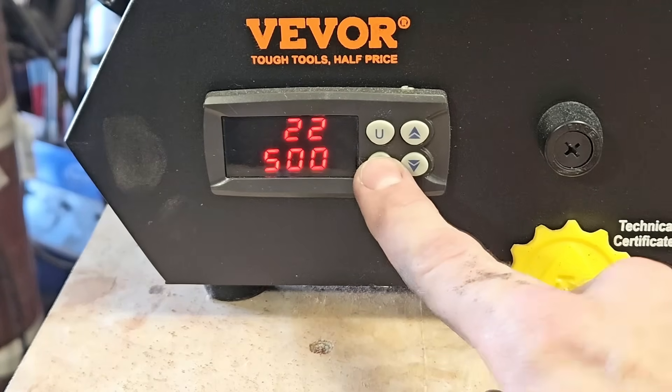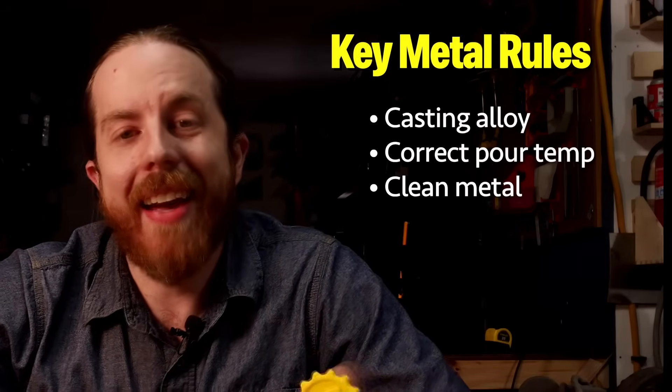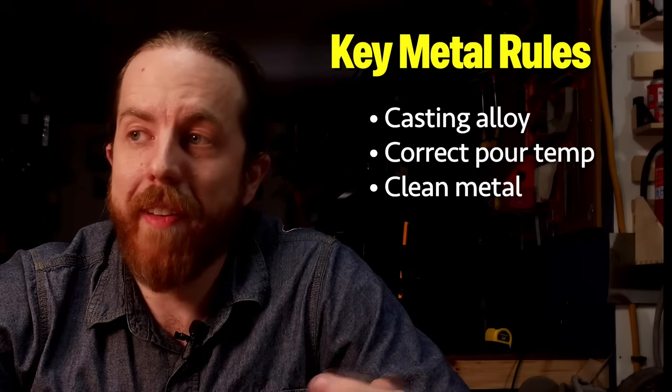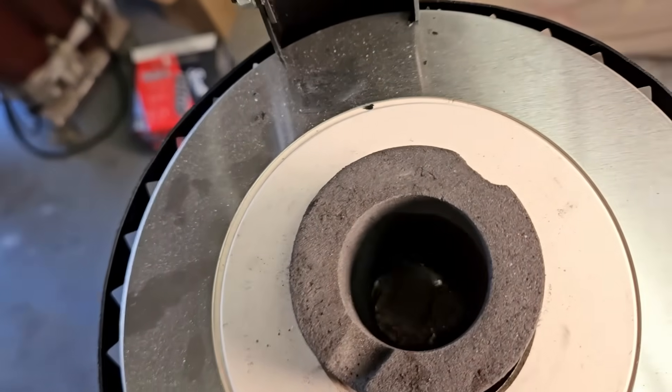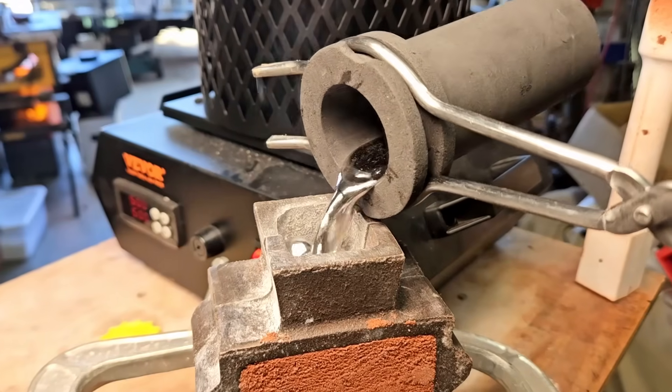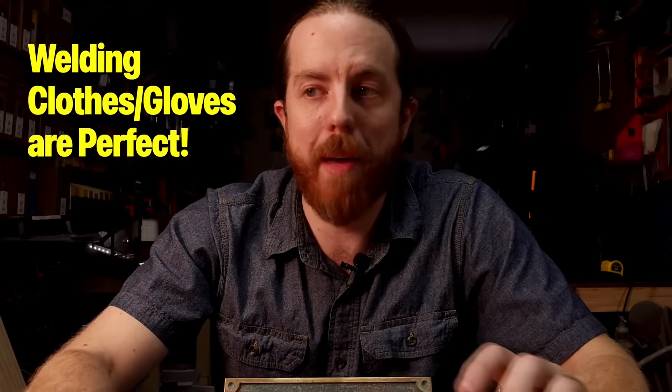With ZA12 I shoot for 500 Celsius to start, especially for a part like this with a large surface area but very thin profile — you don't want to pour too cold. Get a metal alloy designed for casting, pour it at the right temperature, and get clean metal. The pouring process makes people nervous sometimes — you are almost literally playing with liquid fire. You've got to pour kind of quickly; commit, concentrate, finish the pour, and wear leather gloves. I've been doing this for years and have never been injured or burned while metal casting — that's largely because I'm careful and wear protective equipment.